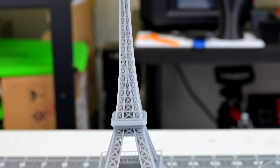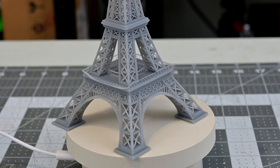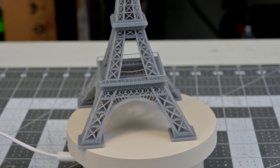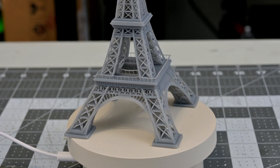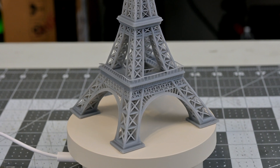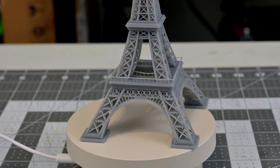I also love the Eiffel Tower as a stress test for resin printers. The Creator Tough resin is interesting — I think the semi-flexibility caused an issue with the railing around the first floor. The railing and pillars printed, but I think they buckled during the washing and curing stage. You can see similar effects with the thinnest lattice members, where they have a little bit of wave to them. The thick members had enough stiffness to remain straight, but the thinner ones were a little flexible.